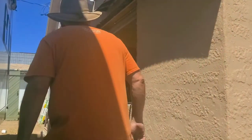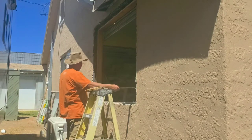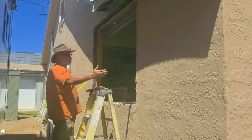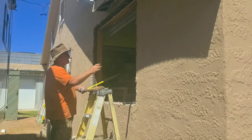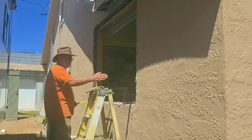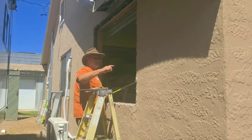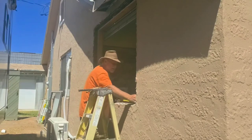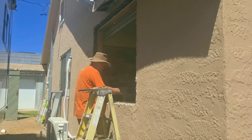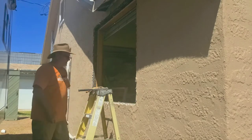This is a 68-inch opening and I'm putting a 4-foot window in here. Generally I'd center it, except this window isn't centered in the room because it was centered when there was a closet. I'm going to keep it to this side. Anytime you can cut down your span, throw something in there — I'm going to leave space for a stud here so I have a nailer. My rough opening is 4 feet 0 inches — that's 4 feet, no inches — and I'm going to bullnose the drywall right in.